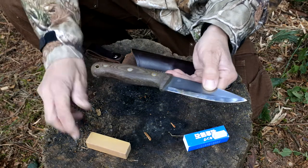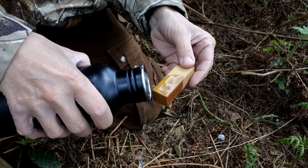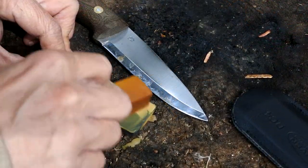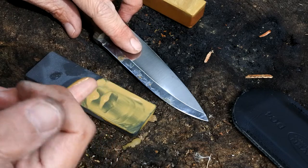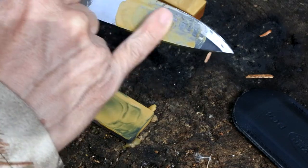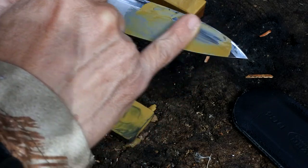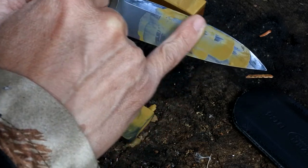When it comes to cleaning the nagura stone, you just need another stone to rub it on and a little bit of water to create the slurry. Then once you've got your slurry produced, it's just a case of applying it to your finger — and I don't have to tell you, just watch your finger as you rub it next to the cutting edge. What this slurry will do with just an abrasive action is help to clean the stain and a little bit of rust off here, and also start to polish the rest of the knife. But unlike the Tourmec or the Autosol, this doesn't leave any kind of residue behind to protect the knife, so once we've done this it'll be a case of drying the blade off and putting a light coat of oil on it before we put it back into the sheath.